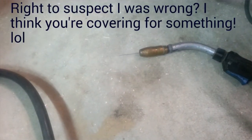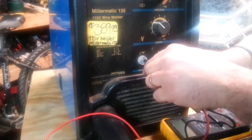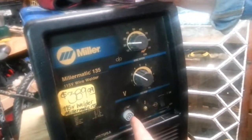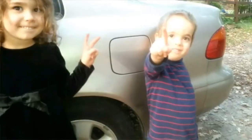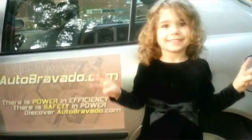This is the wrong way to do diagnosis — to assume your guesses are correct — but I was right. The wire fed when we activated the top right two contacts, so we knew it was the switch. Your jumper confirmed it: only two of the four were good. The switch is what's doing nothing.